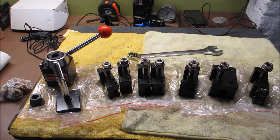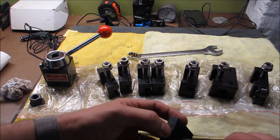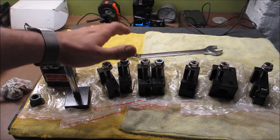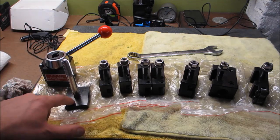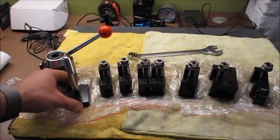So next up is me figuring out how I'm gonna machine this, what am I gonna use to machine it, how much do I need to take off, what shape these slots need to be, and so on and so forth. I'm lucky in that my lathe came in with two square tool posts, and the actual plates were both machined for my compound rest, so I'm probably gonna do the same thing, just measure them out and copy them.